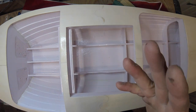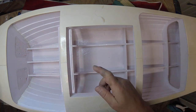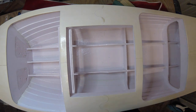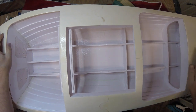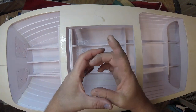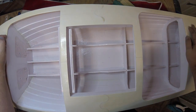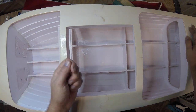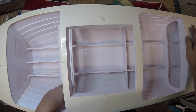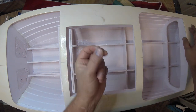I ordered something, and I've tried one other thing before: ultraviolet resin epoxy. And I hated it — it had zero strength, it was super thick for what I wanted. It was hobby grade, like for people who do crafts with epoxy — take little molds and put stuff in there. I threw it away. I bought little bottles and it did work, but I thought this could be way better than epoxy because I could put it on and shoot it with the UV light, or wait half an hour for it to absorb into the wood. That is the difference between 30-minute epoxy and 5-minute epoxy.